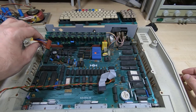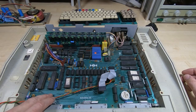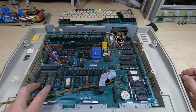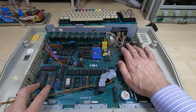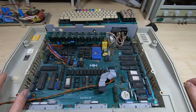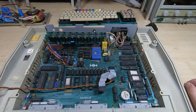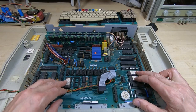We'll take it out to have a look at the underside and see if that has fared any better, and get some idea as to whether it's been worked on much. It's an interesting machine - it's got two Z80s, which is quite unusual for a machine of this era, and there's a 6809 over here as well. This side is almost like a PET and on this side it's kind of like an 803, so it seems like quite a mixture. If anyone has a schematic for this it would be extremely interesting. I'll try and take images of the ROMs, so if anyone has one of these and needs the ROM images that would be useful.